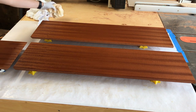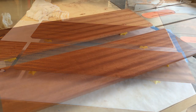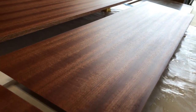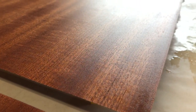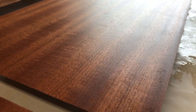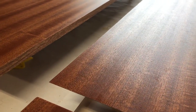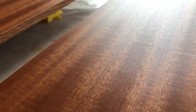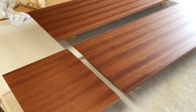So that's the first wipe. Let me bring the camera down. With that raking light you can see it's pretty even now. I'm trying to see if I can find any pinpricks starting. There's some here — as I mentioned, now that we've taken that top coat off, all that finish that soaked in has a chance to rise back up to the surface. Those are the ones we're going to look for every half hour or so for the next few hours. Looks pretty good — maybe a couple little spots. Let me get a couple rags and do a nice final wipe down.